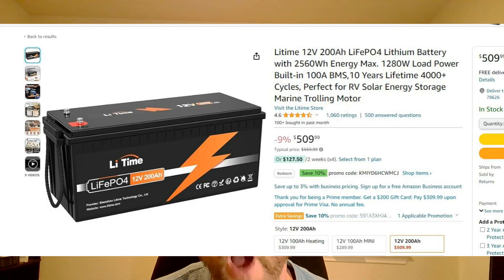A 1000-watt inverter matches a 100-amp battery, which matches a 200-watt solar panel. One of the big advantages to building a system is the flexibility you have. Once you have the core components in place, it's very inexpensive to upgrade certain pieces. I'd strongly recommend going to a 200-amp-hour battery for longer run time. In this scenario, it's easy to spend an extra $200 to go from a 100-amp-hour to a 200-amp-hour battery and double the capacity. Whereas the difference between an EcoFlow and an EcoFlow Delta II — going from 1000 to 2000 watt-hours — is like a $700 price jump. In a DIY build, it's only a $200 to $250 jump.